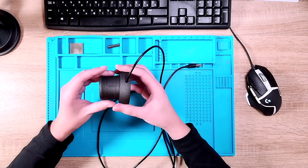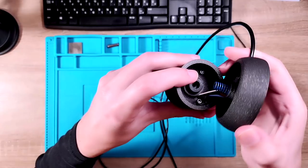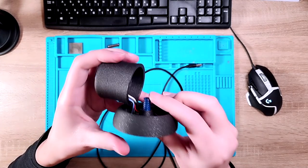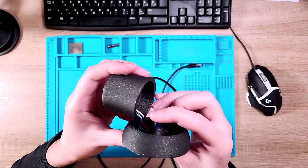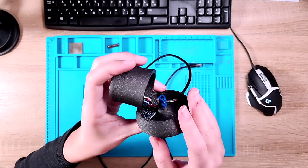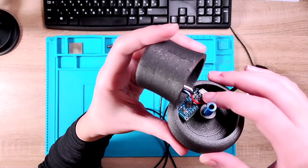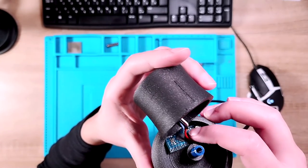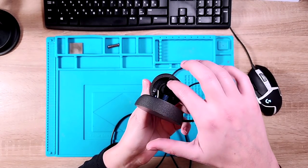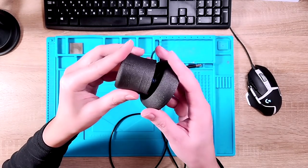Let me take it apart and show you exactly how it works. It's just friction-fitted — the top and the bottom part. As you can see, there is a cavity here at the top, and there is a spring — basically nothing else but a 3D printer bed spring, a quite strong one. It always comes back to the vertical position. There is an Arduino Pro Micro board here, a USB cable, and at the top part behind this plate there is the MPU-6050 accelerometer and gyroscope.